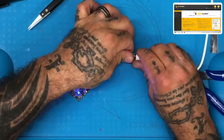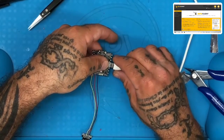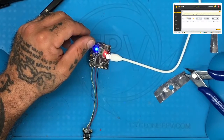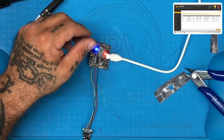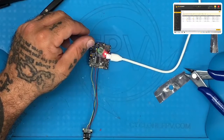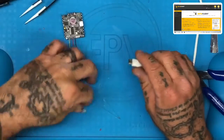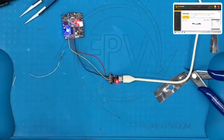The MSP has to be designated on this UART. That's why now that we've put the USB back in, let's go ahead and carefully plug that in, connect to Betaflight. Over here on your ports, you have your VCP — USB VCP. We're going to take UART 3, do the same thing, and click save and reboot. Now, check this out — on our ports we have two of them. Let's disconnect, carefully take this out, plug it in here on the TTL side, and click connect. And holy cow — there you go.